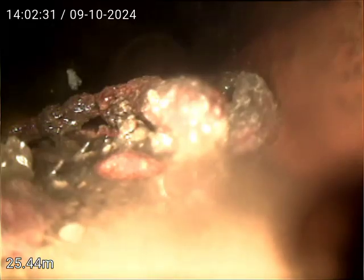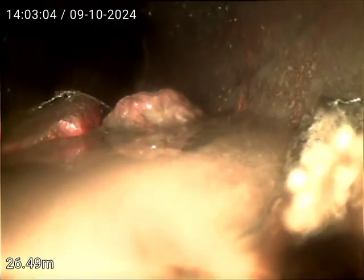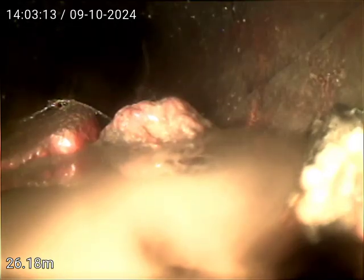Next door is 649 — this is the location, 0.4 deep. There's no blockage; you can see it's hard to tell, but that's PVC further along. A little bit of crap at the bottom, which is not uncommon. It's not blocked from where I can see. It's PVC out into the curb in front of 649. We'll go from down there and have a look and see if we can cross over. We're 26 metres, so roughly 25 metres down. Goes down the driveway and across to the left, across the front of the house into the number 649 property.